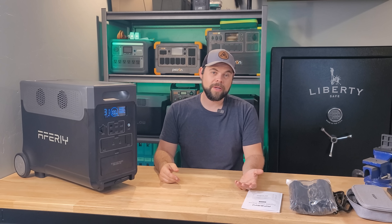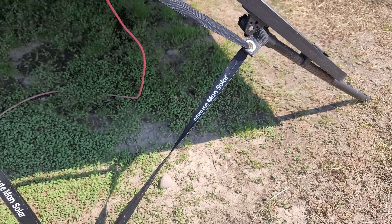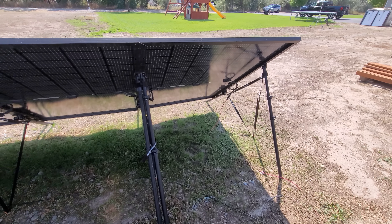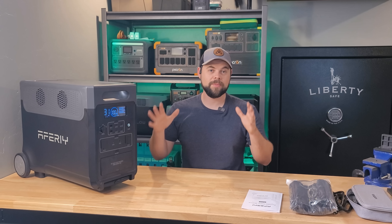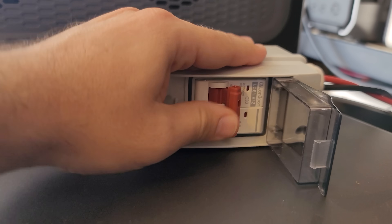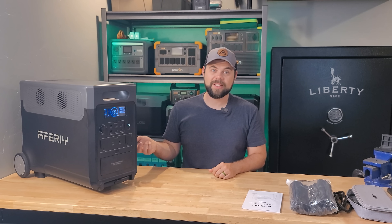For either 200-watt or 400-watt solar panels, I like to use the Minuteman Solar portable solar panel stands, available at poweredportablesolar.com — which will soon be minutemansolar.com. These bolt to any framed solar panel and anchor down so the panels won't flip over in wind and weather. It's about a 150-foot run from my four solar panels to where I had the P310, and I was able to get 1,250 watts out of a 1,600-watt array, which I felt was really good.